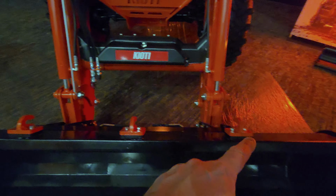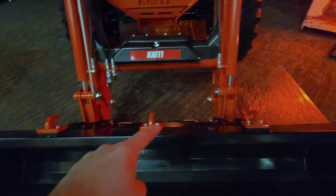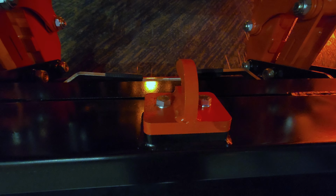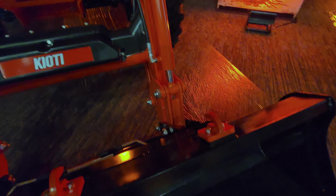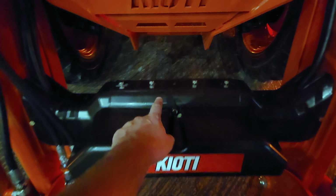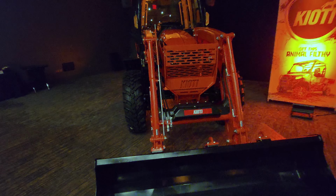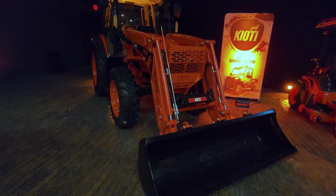And they were talking about these 50-50, they're going to have these on the production model. So, prefabbed mounts for hooks. That's a great way to bend your loader. And then behind these plastic shields is your third function valve and an accumulator to help settle down the hard bouncing this loader can have when you're driving fast. There's a button inside for that. We'll show you that in a bit.